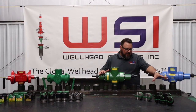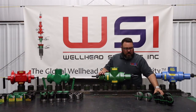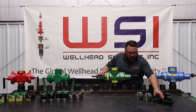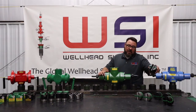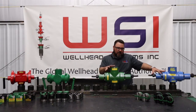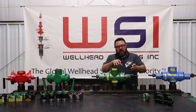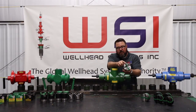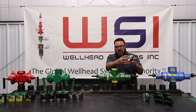You can get these rams blind — this is our snap lock style. You can get them in polish rod specific sizes, or you can also get a molded option. All of these options will fit in our 300T and our 500T single ram BOPs. With the molded rams, the seal is actually molded onto the ram in the manufacturing process, so when these need to be changed you have to replace the whole ram.